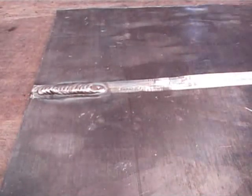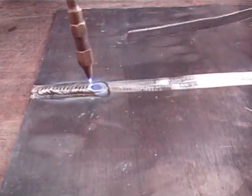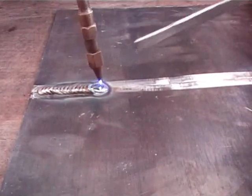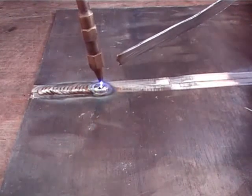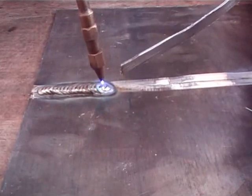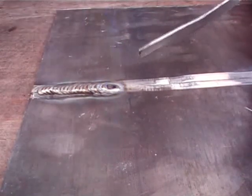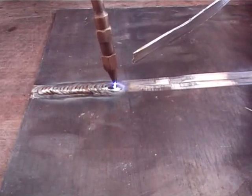Every now and again you're going to have to stop and tap the lead down, because it will rise up through the heat. When you come back, first preheat it again because you've stopped — if you don't do this, you'll see where you started and stopped. Then melt down where that dimple appears and solidifies, melt 2mm off the rod, keep it there until it reaches the width you want, then push forward 2mm. It's important that you let it cool and solidify — otherwise your weld will flatten out because it's too hot and you won't get the strength in your weld.